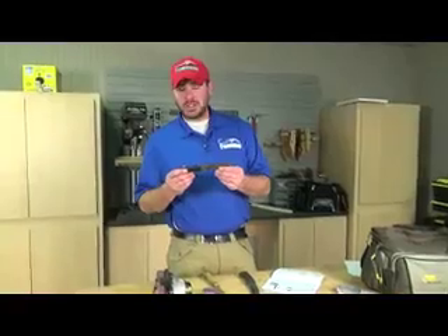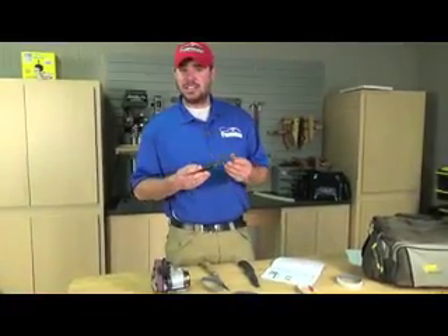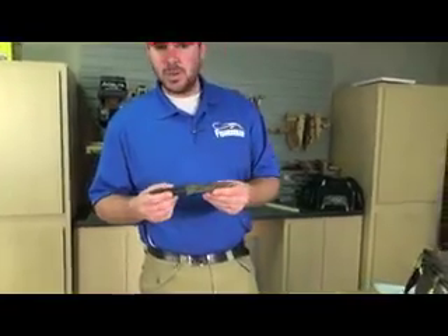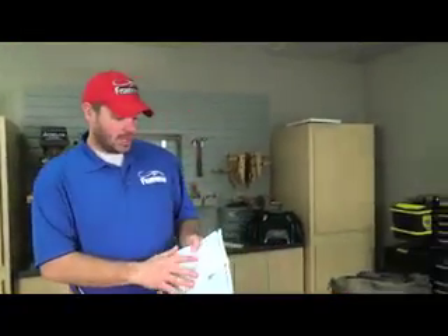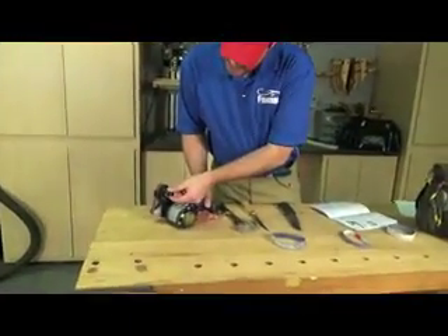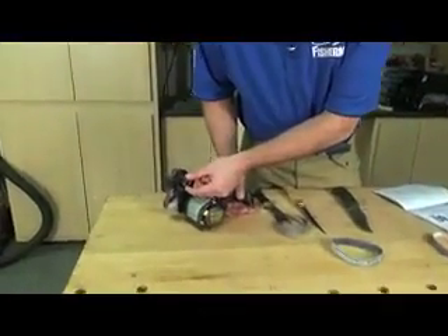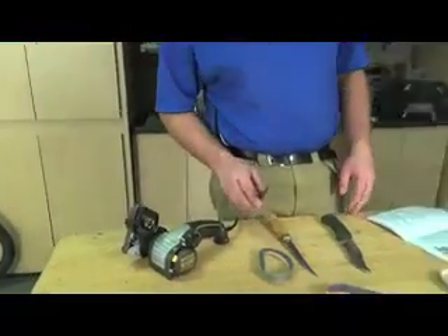I'm going to give you a demonstration. This is the worst knife that I could find — literally picked up on the bank of a river. It's got rust, the edge is gone, and the first thing we need to do is repair that edge. We're going to use the most coarse belt available to repair that edge initially. Referring back to the manual, on this hunting knife it recommends a 25-degree angle. On the side, I select the angle, angle the guides, and turn that all the way to 25 — now it's ready to run the knife through.